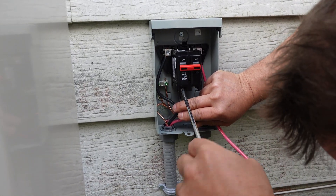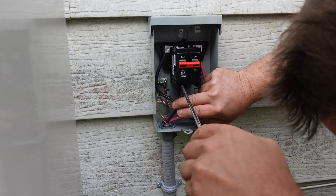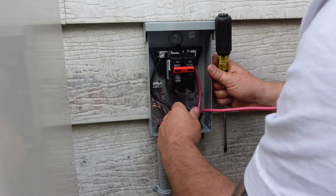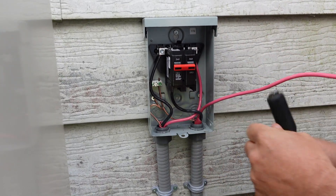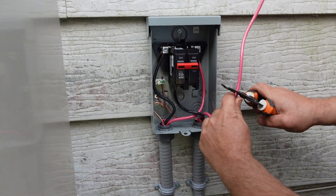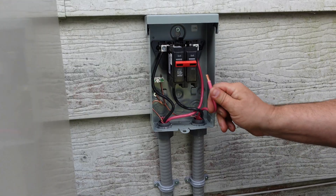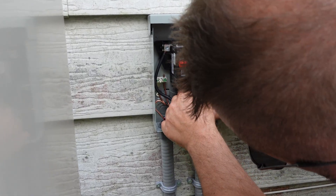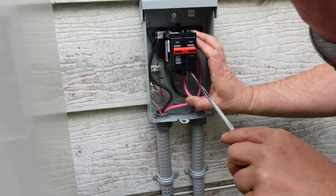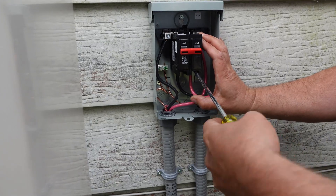We're always careful when we strip our wires. Go up underneath these lugs, make sure they're secured and shoved up in there — hold up on it while we tighten. What we'll do after we turn the power on is do a recording of the exact voltage for the heat pump installer, and he writes that down for his readings. You'll notice we put the black on one side and the red on the other.